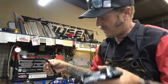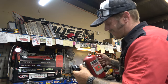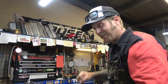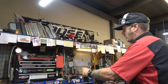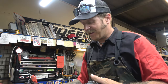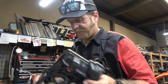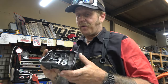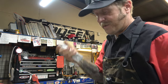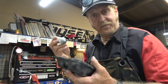We've got the cover out of the ultrasonic bath. Now I'm going to spray it off with some brake cleaner — really just getting all the water off of it. Brake cleaner is super volatile so it dries things out really fast. Same with the gasket. One thing to watch for on these: those little grommets like to fall off, so don't lose those. Now we're going to take some Three Bond 1184 — also called Yamabond — and run a tiny thin bead all the way around. That's going to take a while so enjoy the time lapse.